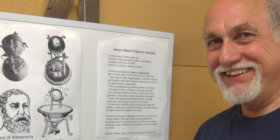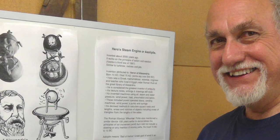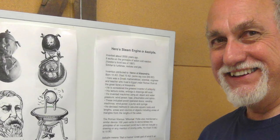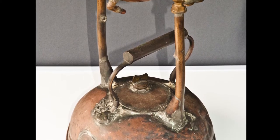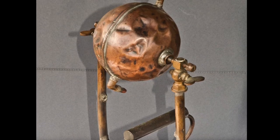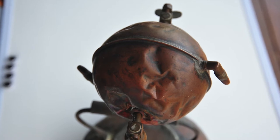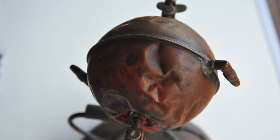They were actually using it to study the forces of air flow, gas flow, and steam coming out of it. The way it works is that the bottom part is made from a kettle and is put on top of a stove or fire to produce steam. The steam goes up the pipes into the sphere at the top, then comes out the little jets, and the thrust from the steam escaping from the jets causes the rotor at the top to spin around.